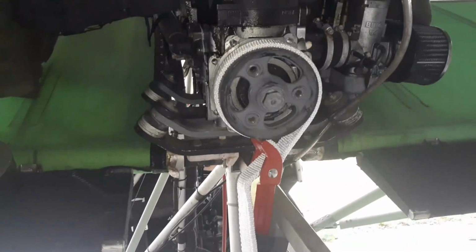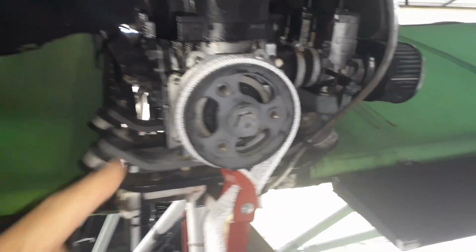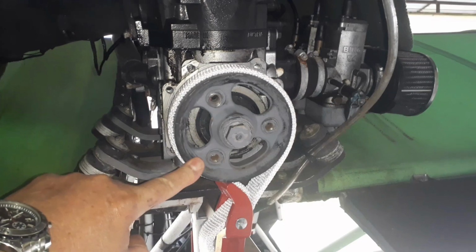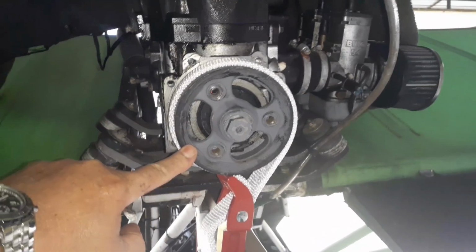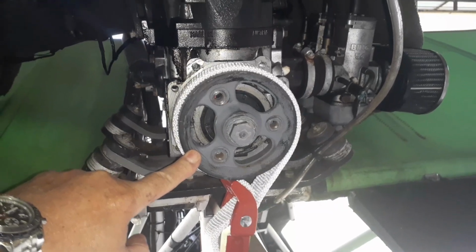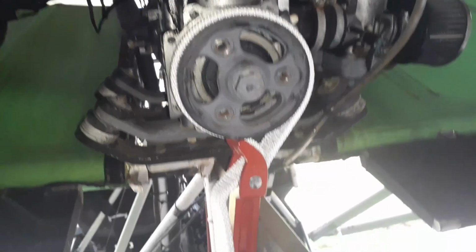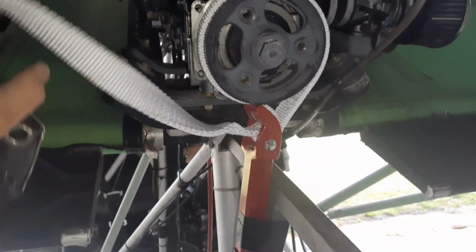so I'm back. I had to wait a few days to get some new bolts from Leading Edge Airfoils. These bolts that were in the flywheel, the heads were pretty torn up. Only two actually came out using the Allen socket. The third one, luckily I was able to get off with a good pair of vice grips, all while holding it with my strap wrench taped to my tail wheel dolly.